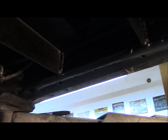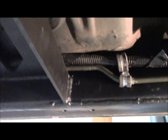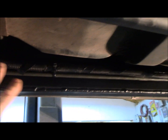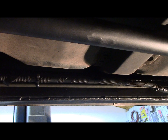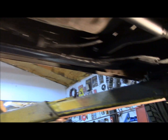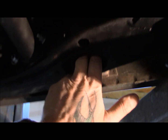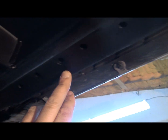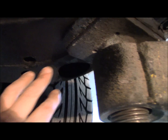So now, somebody had mentioned in the video — don't forget to drill holes in your frame. Very good, very good comment. Because he saw that I was boxing the frame and he said drill some holes in there because you want water and stuff to get out of there. On this particular car, I didn't drill any holes, because as you can see your body mounts come up through the frame. There's holes everywhere — there's holes here, there's a big huge hole here for your body mount, and then you've got all these holes up in here along here, which I didn't drill — they were already in here. And you've got holes in the front of the frame here. But very good suggestion.